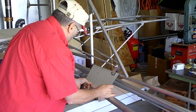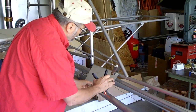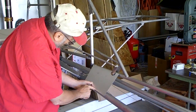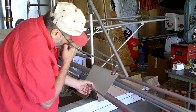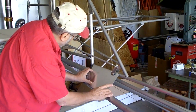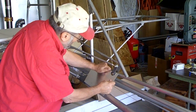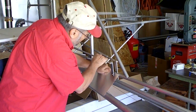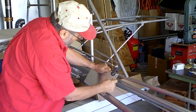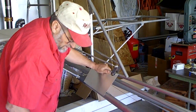Get a good location here. Now along the bottom, I can see where I'm going to take this bottom line that I marked and bend that. I'll put that in my brake and bend it a little bit. What I'm looking for is to make sure that as I move the controls in this U-shape it will be clear. I'm going to go ahead and drill my first hole.